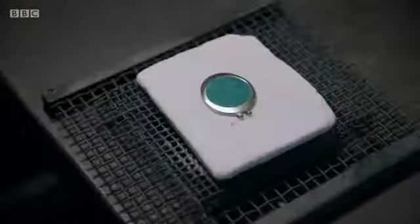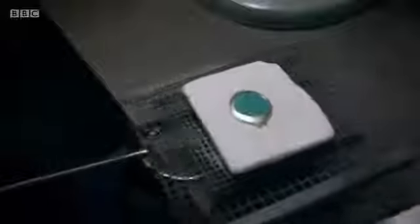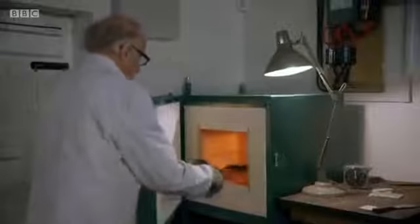Simon has inherited his father's love for deep, lustrous colours in enamel. It goes on the stand. The material is the ceramic that they use on the space shuttle tiles. It's ideal for firing enamel on. It's not so bad on something like this, but if it's a beaker where you've got the enamel on the sides, you have to make sure that it's perfectly dry, otherwise it just drops off the moment you put it in the kiln.